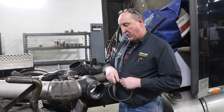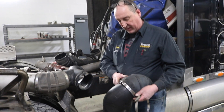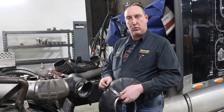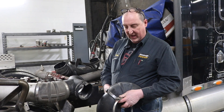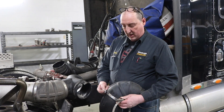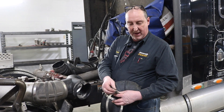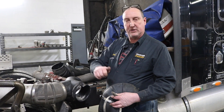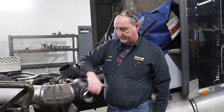You want to make sure you don't over-tighten these. It's more prone to happen with this style than this style, but you guys that tighten everything with a little cordless battery-operated gun, you've got to pay attention to what you're doing. You have to have a feel for things. If you don't have a feel, get your ratchet out and do it the right way. I only use a little pocket ratcheting screwdriver with a 5/16 socket on these. I'll run them up, but I know when to stop and then I'll put my little palm ratchet on and check them. You don't want to exceed 40 inch pounds of torque. If you don't have the feel, you need to start torquing them or else you're going to get dirt ingestion and wipe out your turbo.